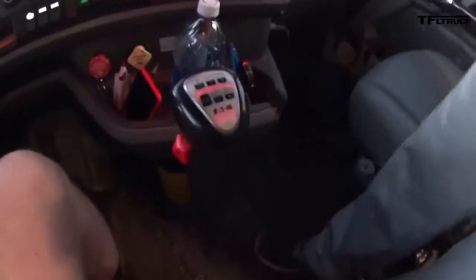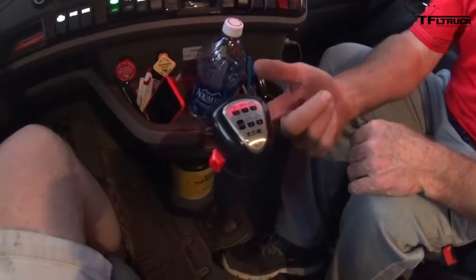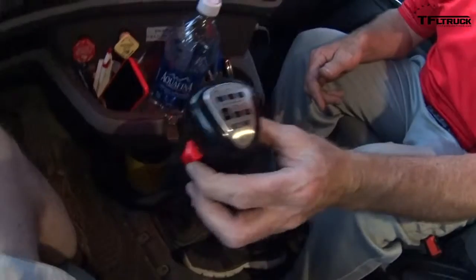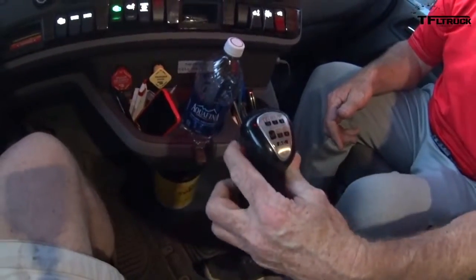That's a 13 speed. So you go through your bottom set, and then you split it to the high side. And then go back through the gears again, and you go, that's low, and that's high. That is what you do.